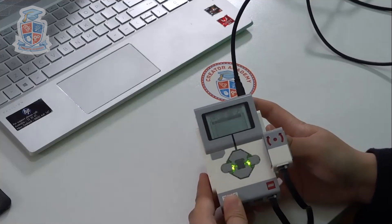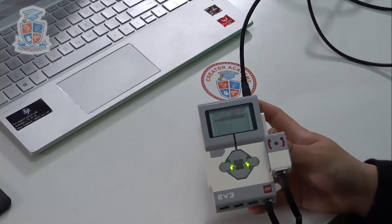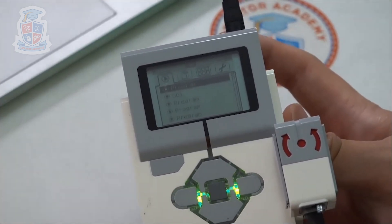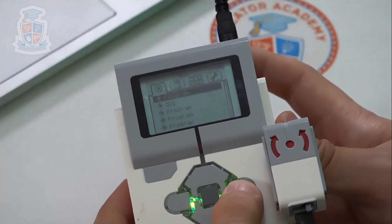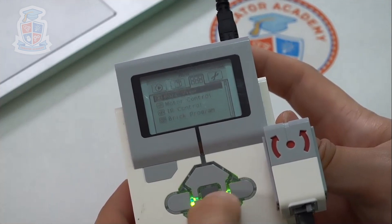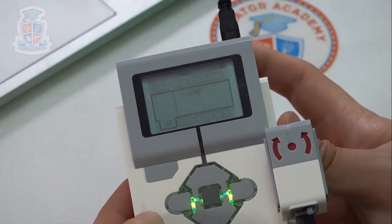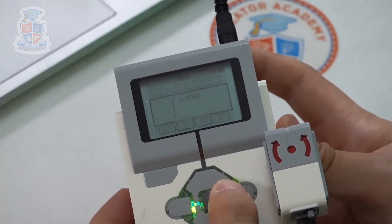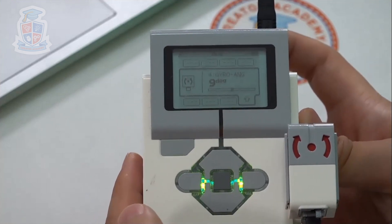So when you switch on your gyroscope, let's have a closer look at this. You're going to see here the screen for the EV3. In order to check my gyro sensor reading, I go to the side to port view, click on it, and then you'll see down the bottom right — because I'm connected to port number four — you'll see that it is working properly.